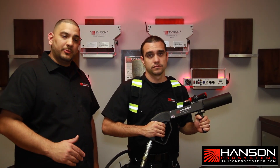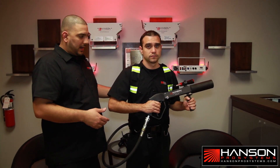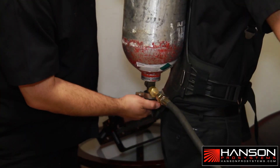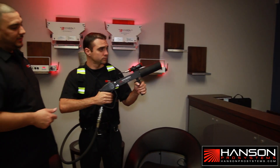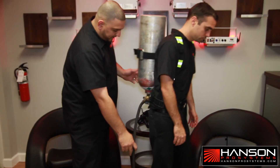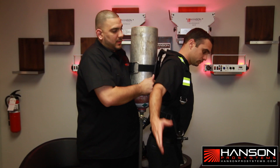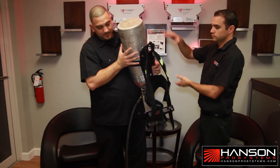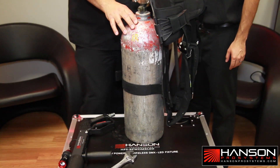The next step is to properly show you how to drain the CO2 gun and the actual CO2 hose to be able to remove it from the person that's helping you out. We're going to physically close the valve all the way. Once you close it, you're going to make sure you drain it. Once you hear normal air coming out of the gun, that means the hose is completely drained and the gun is drained as well. Next, grab the gun, come here with the quick connect, release it and put the gun down. Try to put the hose facing down so it doesn't hit anybody. Then come here and help the person with you take it off. Take the strap from the bottom down, pick up the tank and release. Come place it down. Make sure the tank is securely on a surface that's flat and doesn't shake. And that's pretty much it.